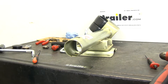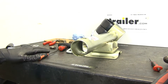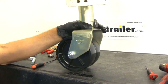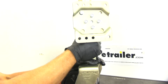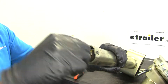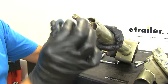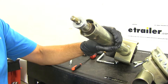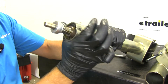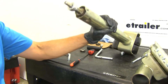Now if the gears are your concern or if your gears are the issue, we're just going to reverse that process for putting the gears back in. But there's one other component, and that's the bearing we talked about. We'll stand our jack upright, lift the outer tube off of our inner tube, and you'll see right there is where that thrust bearing is going to fit. That one will come off — grab our new bearing and slide that right back on. You'll see our screw mechanism there. As we turn that, it pushes the foot further away from the top of the jack or brings it closer, and that's how our jack essentially operates.